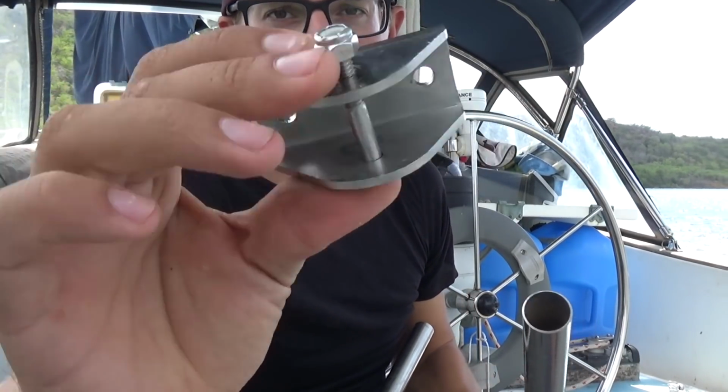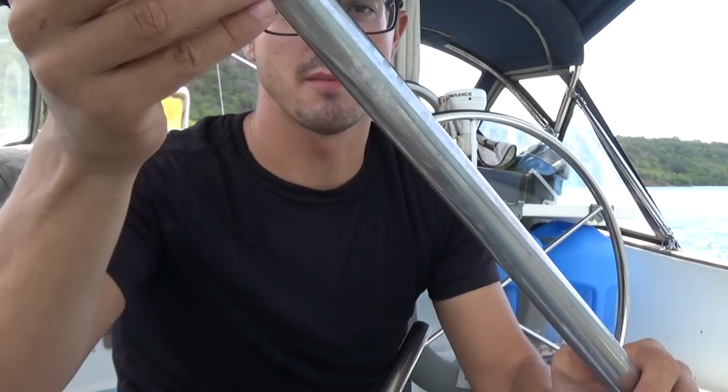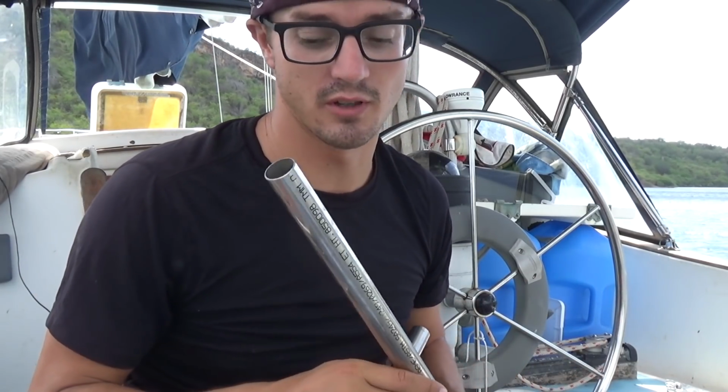And the other end of this gets mounted with this little plate here, and that's going to be mounted up underneath the deck somewhere to make the forward end of this mounting tube very secure, because it takes a lot of torque from the quadrant. It also takes a lot of drag from the servo pendulum dragging through the water, so it needs to be really, really secure.